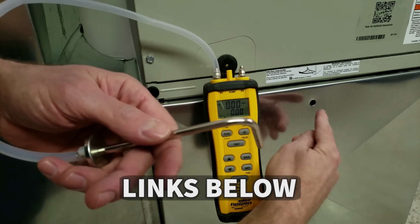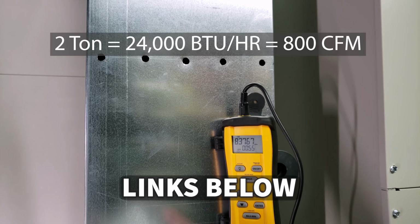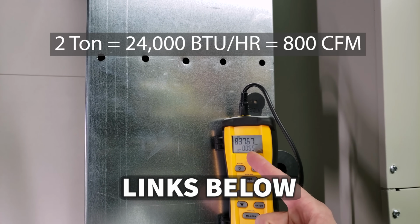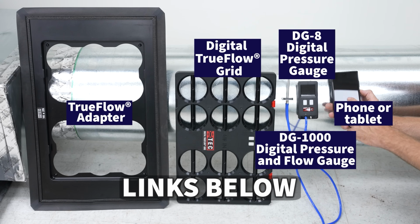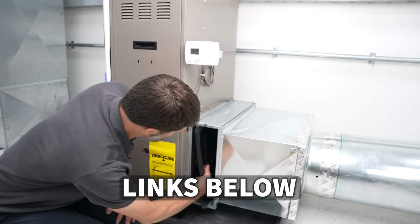And before you measure the refrigerant charge level, make sure to check your airflow so you have the proper amount of airflow across the coil for every ton of air conditioning. I've got several videos linked down in the description section below on that. And one of the easiest methods is with that TEC True Flow Grid. So let's go ahead and get started.